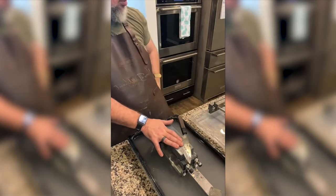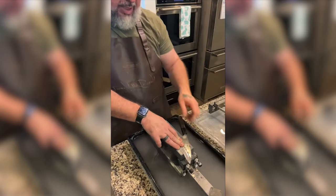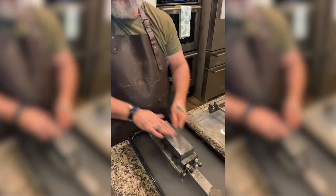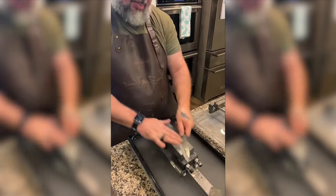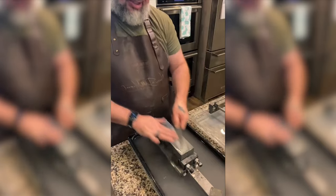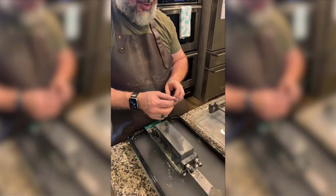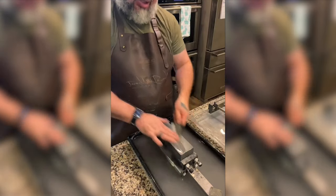Hey, listen, Scott, thanks for coming back, man. I didn't know if the 300 was supposed to be pre-soaked, but I soaked it for like 5 minutes. 300 King, by the way. I finally eased up on the pressure and started letting the stone cut and put the scratch marks in. Way better result. I feel like the low marks are definitely almost gone.